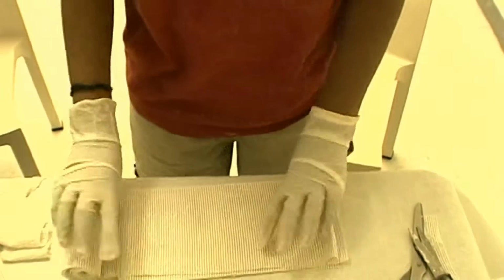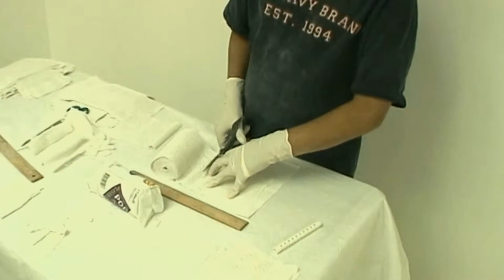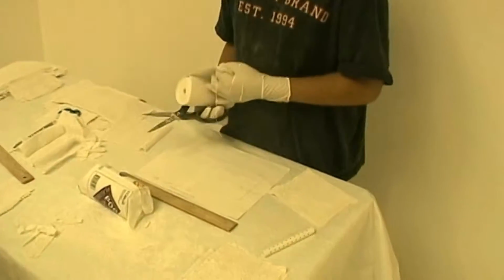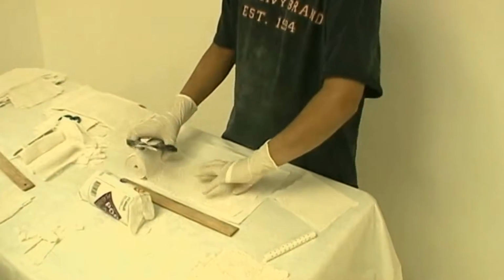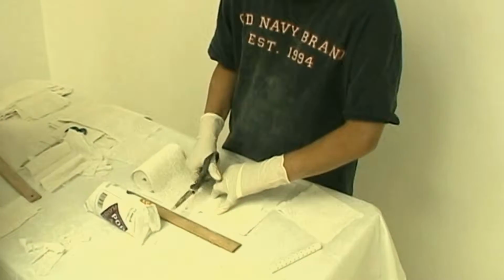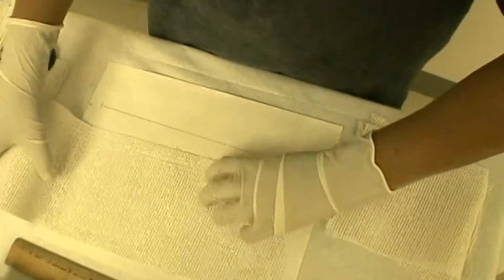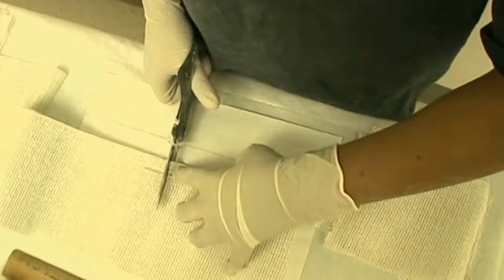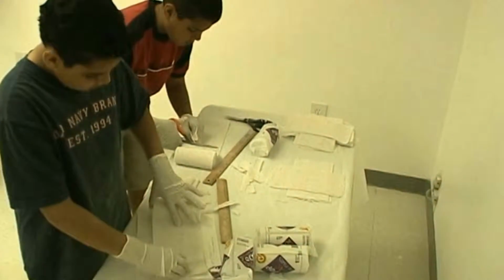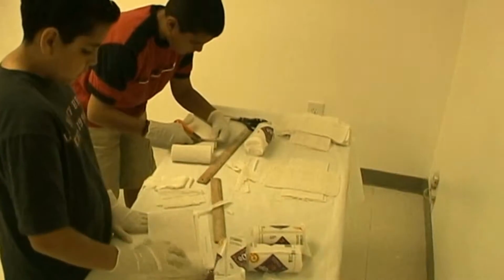As you just saw from the diagram, each set of bandages are combined in 3s. This gives the shell extra strength and saves considerable amount of time when the bandages are applied 3 at once. Though a ruler is very handy for measuring the lengths of bandages, it's easier to mark the lengths on a sheet of paper and then simply match the bandage to the lengths, then cut. A sharp scissors is a must since the bandages are thick and not so easily cut. Set of bandages and lay them out in an X shape so that they can be picked up quicker.